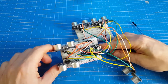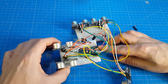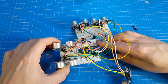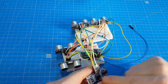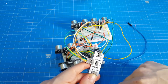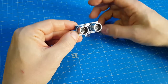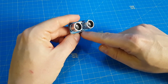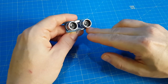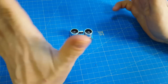Before I fully assembled this, I built a prototype with five ultrasonic sensors and an Arduino Nano controller, just to see if it's worth the time and effort. I'll put the sensors on the end. The Arduino will share the same common ground and voltage line, and each ultrasonic sensor has its own echo and trigger pin connected to the Arduino. If you're into Arduino, you should already have played with this sensor — it works by sending a command to the module that emits an ultrasonic impulse.